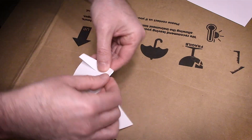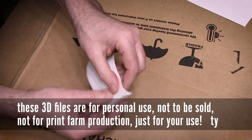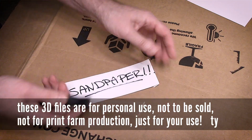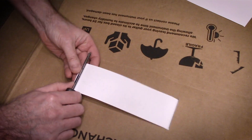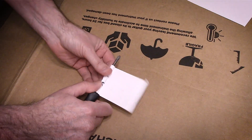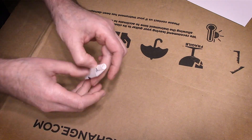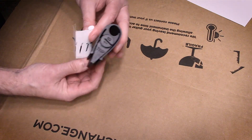Use your imagination just a little bit — pretend this is actual sandpaper: 600, 800, 1,000, 1,200, 1,500, 2,000, 2,500 grit paper, whatever you might be using. Cut it to a two and a half inch wide strip by whatever length — this is an eight and a half inch length on the paper. Fold about a three-eighths to half inch lip on one end, and then roll it up. I use a Phillips style screwdriver shaft and roll it up nice and tight.